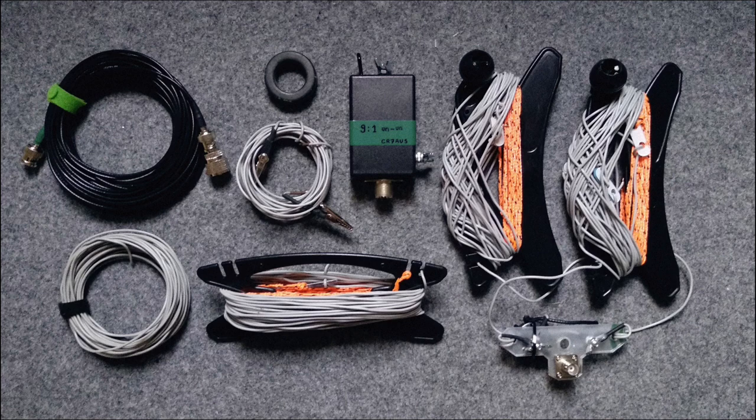The next image shows his antennas laid out — at least two of the three. Over on the right-hand side you'll see the simple dipole. Dipoles are always great antennas and resonant for the band you've cut them for. Then we see the 9-to-1 UNUN and the wire that goes with it. It looks like he's got a couple of different lengths of wire he can use with the 9-to-1, as well as a counterpoise, and then a roll of coax.